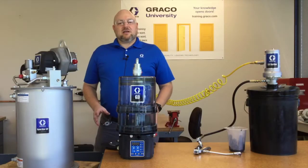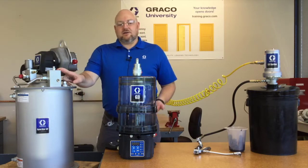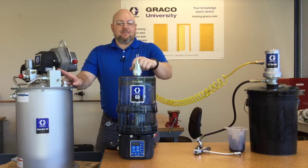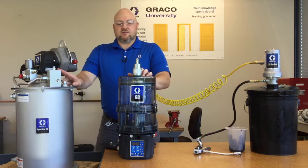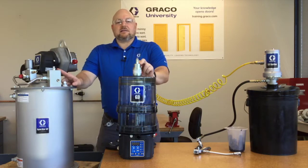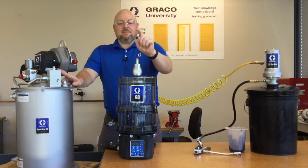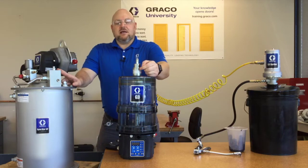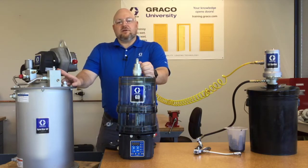Now that was a look inside of the Dyna-Star valve, which is rectangular, but the G3 valve works the same way. It just happens to be round so that it would fit better on top of the G3 reservoir. But it's the same thing going on inside, where there's one long pin that causes the pin on the top to stick out when the plate pushes it up, and there's that poppet that in the process closes off the fill path of the grease reservoir.